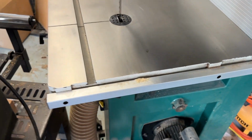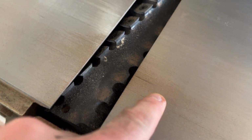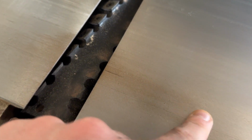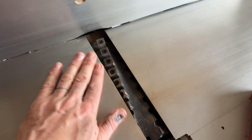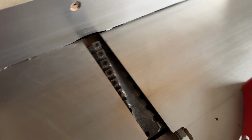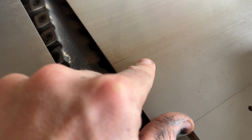The bandsaw is looking pretty good. This doesn't get as much use. The joiner, obviously you're pressing down and you're running boards over it. You can see there is rust forming here. So this carbon method stuff works. If you have an indoor shop, it's going to hold up a lot longer, but I mean, it's not magic. It's going to wear off. Again, it's only been 3 months. I got rust forming here, so I'll hit it with another treatment.